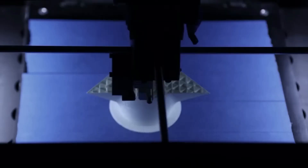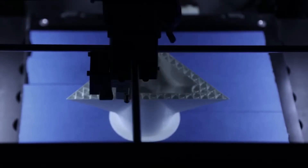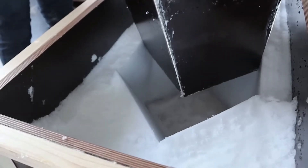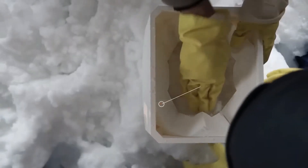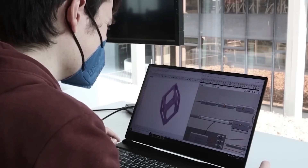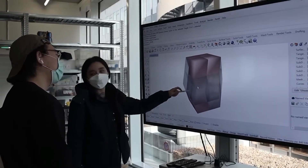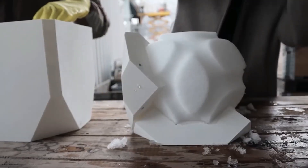This Cold Production project was created by students of the Master in Advanced Studies in Architecture and Digital Fabrication in Zurich. Ice units were formed using 3D-printed molds in the sub-zero lab at minus 10 degrees Celsius, enabling rapid and waste-free production. Concrete was poured into these molds, cured, and then placed outdoors for demolding as the ice melted away, revealing intricate lattice designs. Custom computational tools were employed for design and fabrication, utilizing a geometric pattern inspired by a dodecahedron honeycomb.